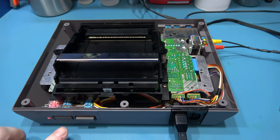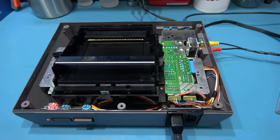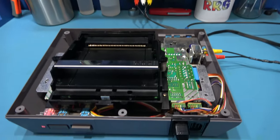That's pretty good, guys. If you remember my previous video, I said when you disable the lockout chip, you either get a white screen or a purple screen. Well, there's your purple screen. One other thing you may notice is it's full screen. And if you look carefully, my camera is shimmering. That's telling me that's at 60 Hertz, because I'm filming at 50 and this is 60, and I'm getting that shimmering on my camera. So that's a really good sign.